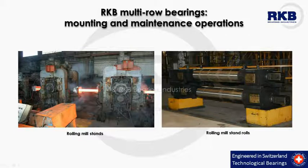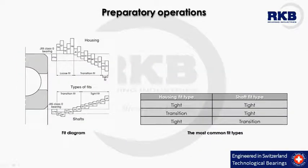In almost all cases, the analysis of the mounting, dismounting, maintenance, or lubrication starts with the study of the type of fit suggested by the designer of the machine or installation. The choice of the fit type is made by the application designer, depending on load magnitude and direction, rotational speed of the moving part, shafts or housing, bearing element with a rotating motion equal to zero, inner or outer ring, lubrication system, lubricant type, and all the other factors relevant for the performance of the machine.